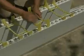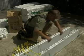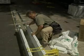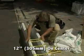Now place the ties so they straddle each deep groove in the panel at 12 inches on center. Set an additional pair of panels in each direction, working away from the corner, placing ties at 12 inches on center using the deeper grooves as a guide.